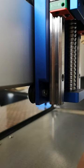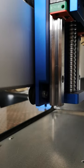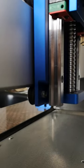Once that's done you'll see that the eccentric nut is flush with the metal, which is very important, and you won't have any left to right wiggle room but you will have a nice smooth movement on the X axis.